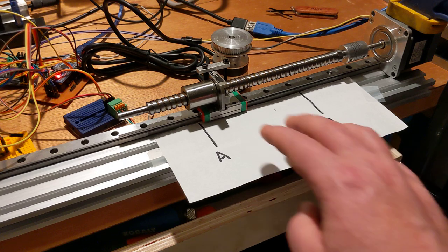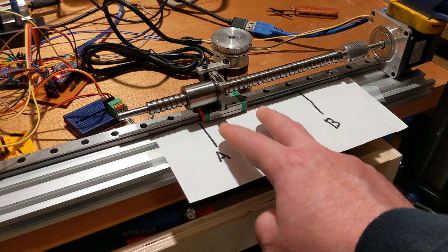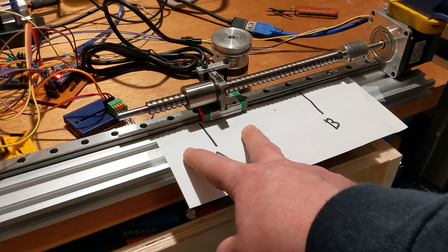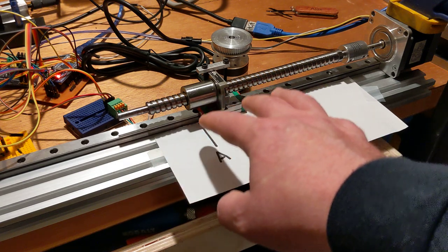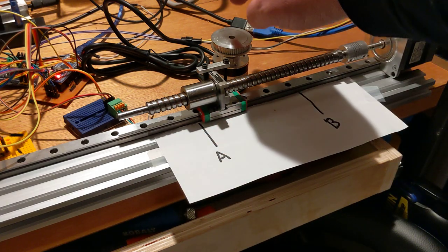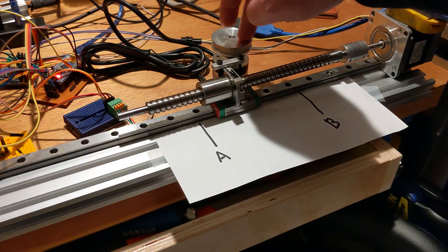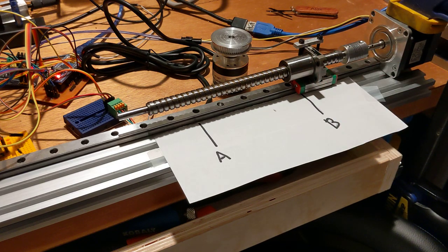Now, the other components are, I'm calculating a curve for the steps. So I scale from 0.01 steps to 2 steps, and I'm actually using a function to create a curve to do that. I'm cubing the velocity and then multiplying that by a constant, and that gives me a curve that I can manipulate. The feed rates, currently the way I have them set, are linear, and I'm not sure how much that's impacting my ability to operate this really accurately, to be able to stop where I want.